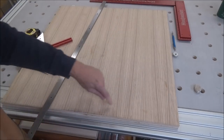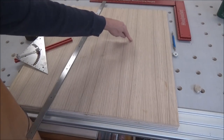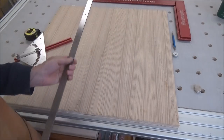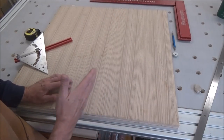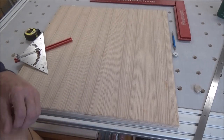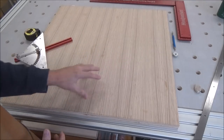I made sure I had enough at the base, which is 15 and a half, and then a 17-inch line up from the base, parallel to that. Now I really don't have to worry about anything other than making this first cut — then the rest will be very simple. So the big question is, how do you make this cut on such a large piece?